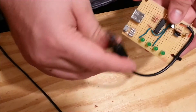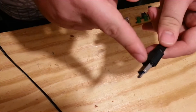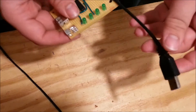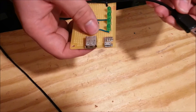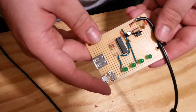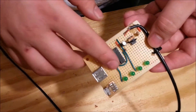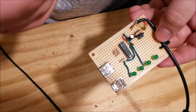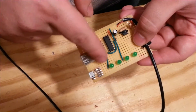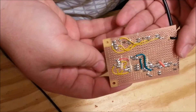I have a 5 volt USB input right here. It's a micro USB host cable inside of a normal USB cable, so you can plug it into a USB port or use your phone as a supply if it supports host — which is really cool. I decided to use this because I wanted to be able to test USB cables before I buy them. If we look at the board closely we'll see the 4017 right here, the 555 timer with all of its components, the 4 LEDs that will blink in synchronous order, and the output resistors. The output goes synchronized through the USB, tethered via USB cable to micro USB, and the outputs turn on the LEDs one at a time.